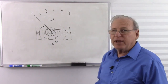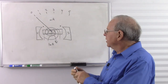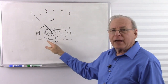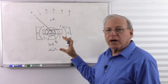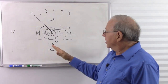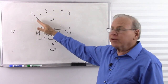So how can we have that read voltage? We know the electromagnet has a certain resistance — let's say one kilohm. Using Ohm's law: one milliamp times 1,000 ohms equals one volt. So I get the same deflection for one volt as I do for one milliamp. I can calibrate this in milliamps or in volts — it takes one volt to get one milliamp. So this is actually also a voltmeter reading one through five volts.